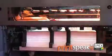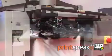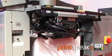DI presses run without traditional press consumables, so we don't have any alcohol, fountain solution or water in the printing process. This allows us to print very high quality from very lightweight stocks up to stocks 0.5 millimetres in thickness.